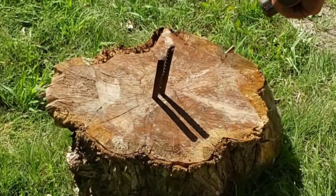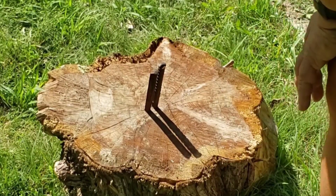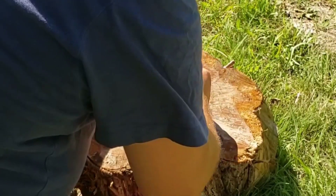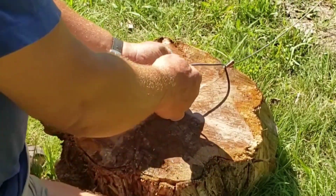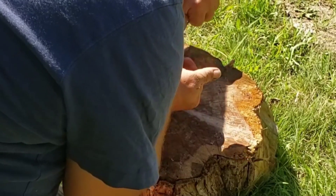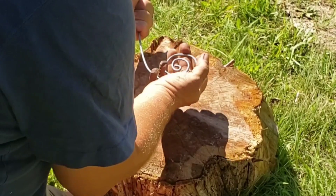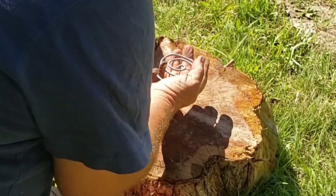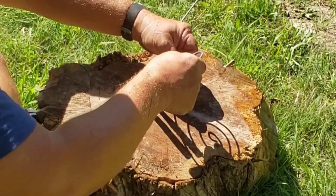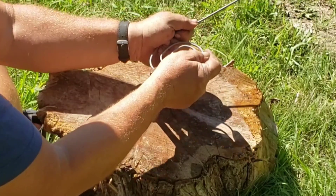Let me give that a tap — I want to shrink it up a little. As it follows around, you keep one in between, and the thickness of the one you're going around determines how thick and how tight the spiral is. You can easily make a jig, but this way most anyone can do it. All you have to do is have a log and two nails, basically, and just form it up. As big as you want it — the heavier the material the tougher it'll be, but also the harder it'll be to work.